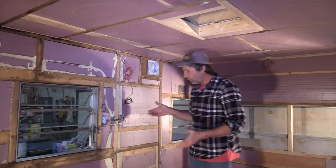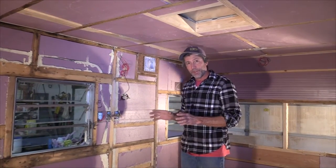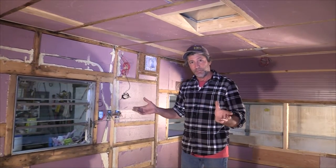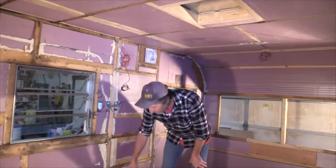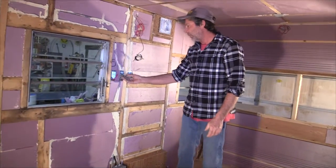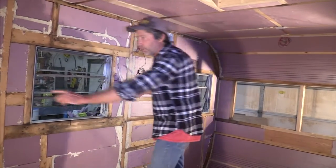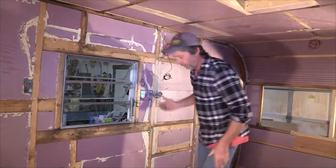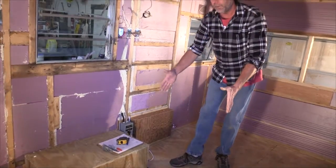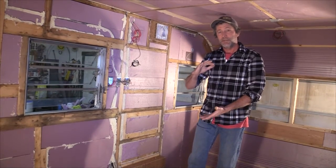So what we did here — we're bringing 110 volt in and 12 volt in. Everything is really super simple, nothing complicated, fewer things to go wrong, fewer things to start the thing on fire. So 110 comes in here, goes to this breaker box, and then up here we have a 110 outlet that will be above the countertop. Over here we're going to have a switch for the 110 that will power an outlet down here — this is where we're going to plug in a space heater. Here in the Midwest we call them milk house heaters; it's just a small, very safe electric heater. We'll be using that to heat the place.